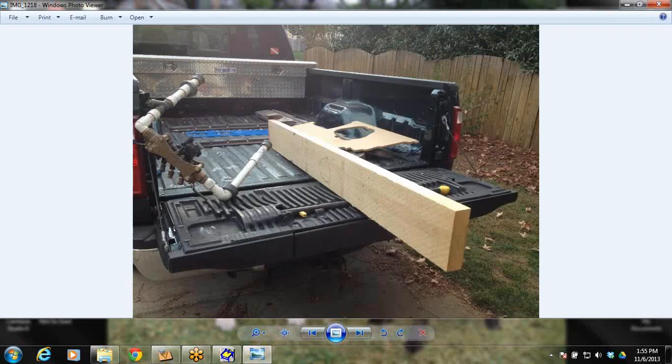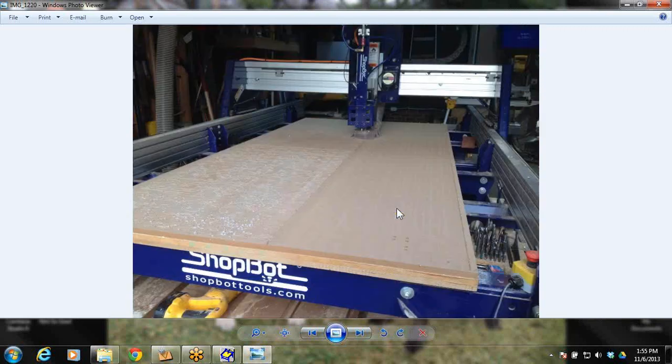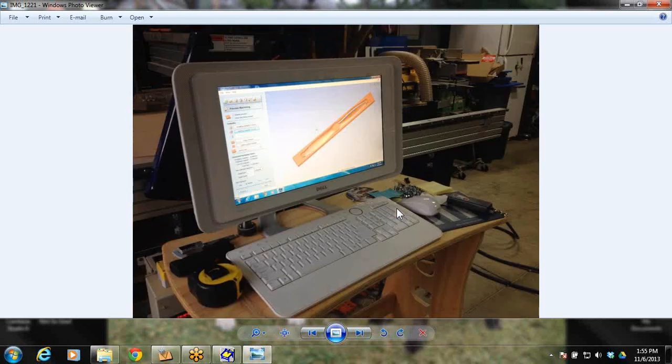This is the one I showed right at the beginning. Just a recap. We take our material, know the dimensions of this, because that's what you're going to draw it in. Have a nice flat top for it to be machined flat so you can do a flip. Go through and do the PartWorks 3D. Make sure you're doing both sides. Make sure you have an overcut, so you have a file like this where it needs to actually cut down below 0.